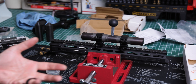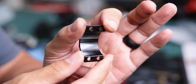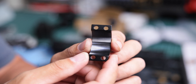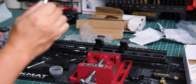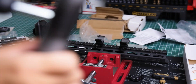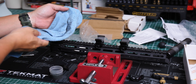Now we're going to remove everything and see what the finish looks like on the inside. As you can see, there's a clear difference between when we first started and now — this should be in much better alignment, if not perfect. You can see the lapping compound on the bar; we'll get that cleaned up. One thing to note: the lapping bar itself will also wear — you can see how worn it already is from that 220 grit.